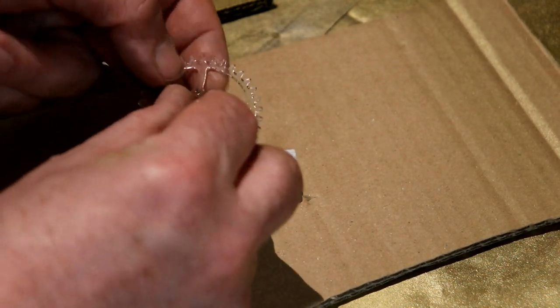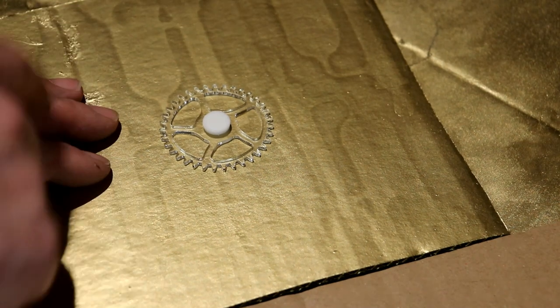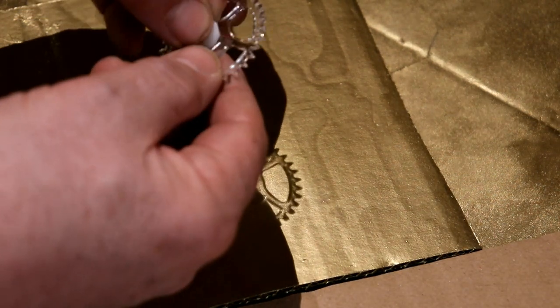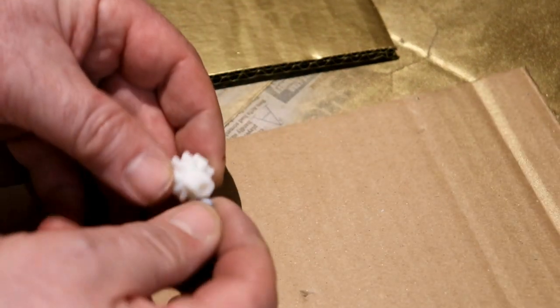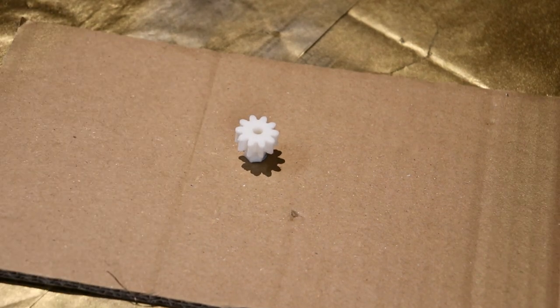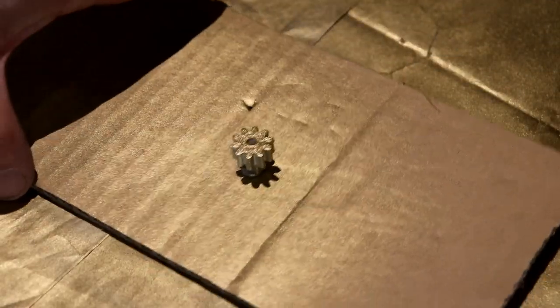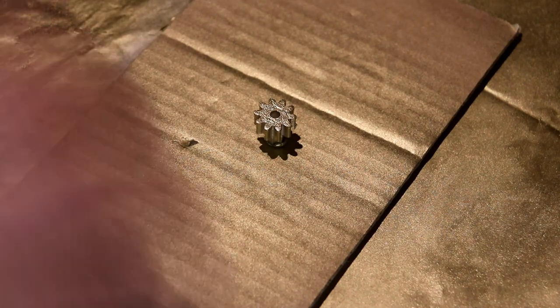Because I want them to be different colours, I'm going to put the little paint mask back into the centre of the gear and sit that on a bit of card. You don't have to spray the back of it, just the front — it doesn't matter which way round it goes. And then I'm going to paint this central gear a different colour — I'm going to use a little bit of blue tack just to stand it up so it won't fall over when you paint it because of the pressure of the paint. I think I'm going to do this part brass, so get the brass paint again. Make sure it's still shaken properly because it does settle, and then do the same thing as before, just turning it through 90 degrees, then clear the nozzle and leave that to dry.